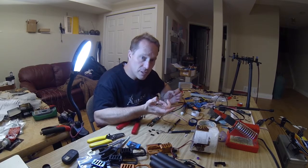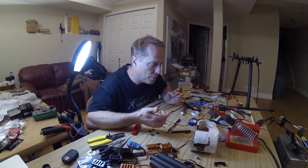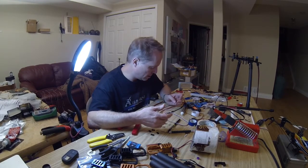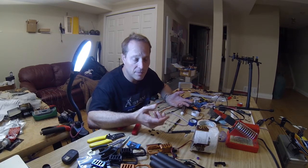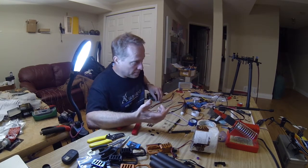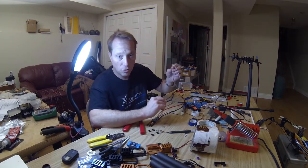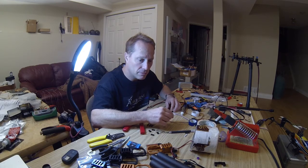There's another reason for this too. I like to take apart a lot of these things before I put them in. I get them from the manufacturer, and there's always a chance that something is not necessarily up to snuff. So I make a point of testing these things and checking them over. For example, some of the ESCs had short control wires and some had long wires — that's pretty sloppy, in my opinion, to not have all the same.